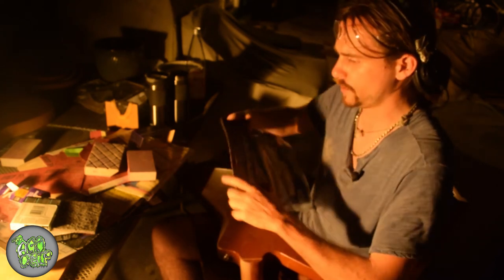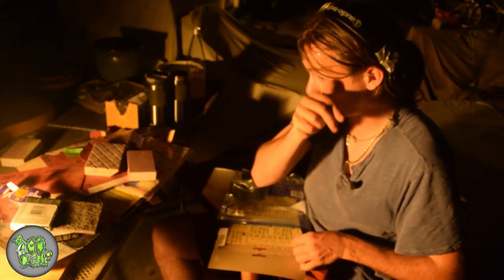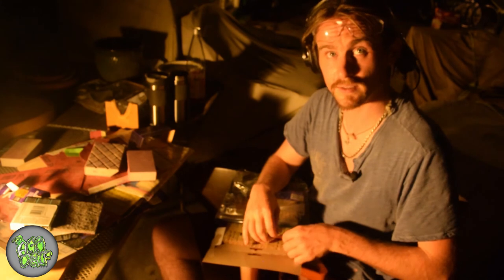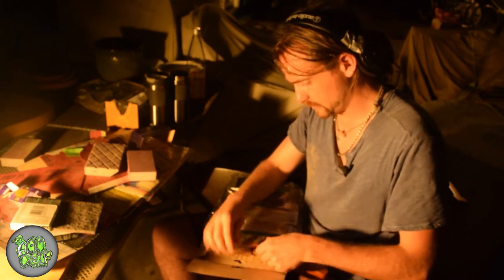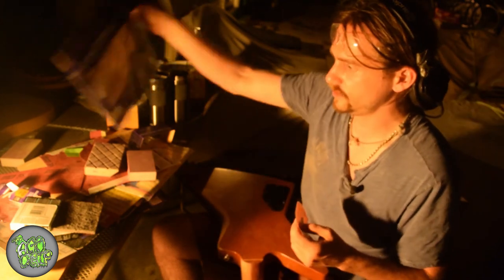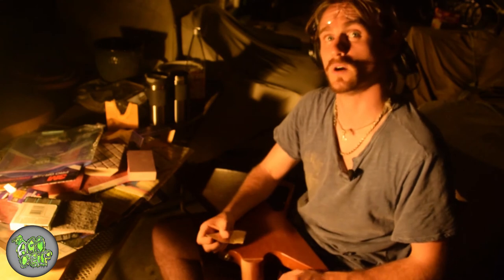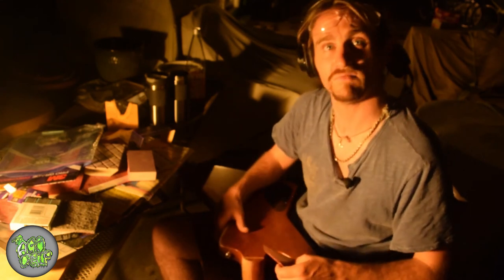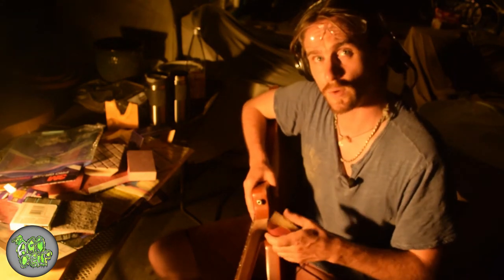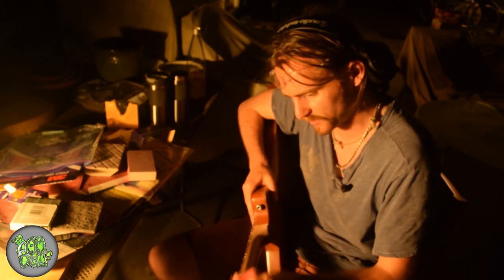And then after 320, I'm going to skip the 400 grit and just go to the bristle pad, the Scotch-Brite. And after the Scotch-Brite, I will be ready to pack all of this up, be done for the night, and tomorrow I will lay on my first coat. I'll film that, and you'll see that in the morning. Linseed oil. That'll be in the next video. So this video will go up, and then you'll see the next one.